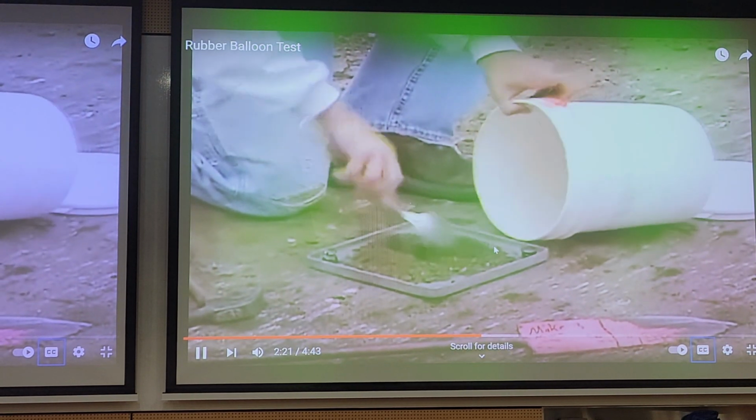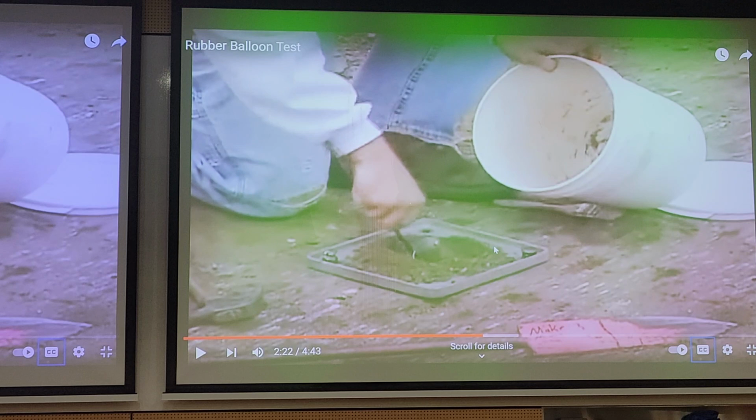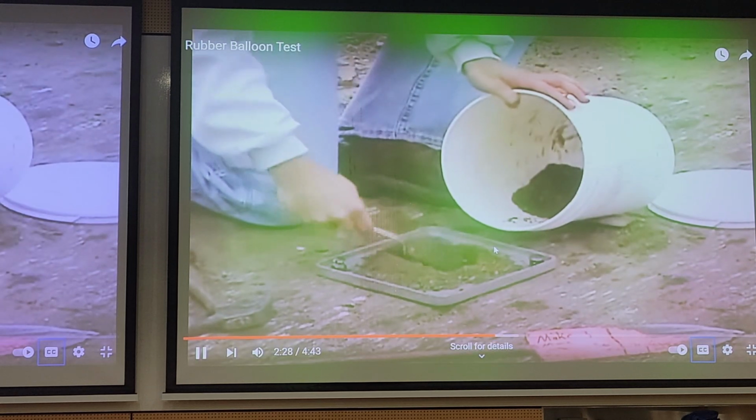Place all of the loose material from the hole into the container. So the procedure is more or less like the sand cone test. You have to be very careful not to lose any soil. You can imagine this is quite difficult to do on site if you don't have a lot of space, like this technician does. Then weigh for weight and moisture.